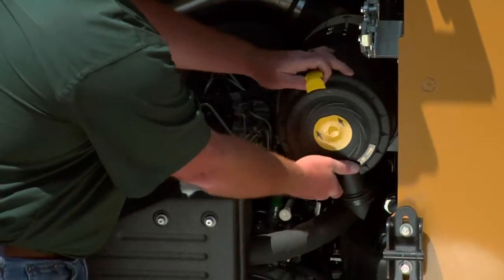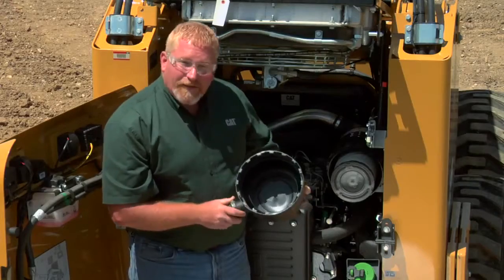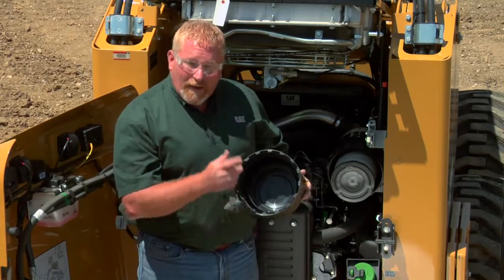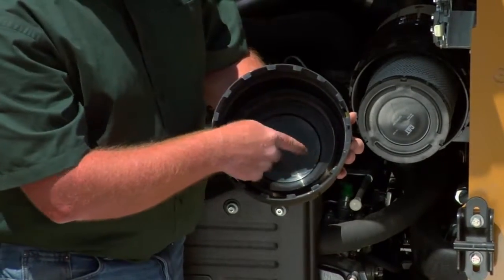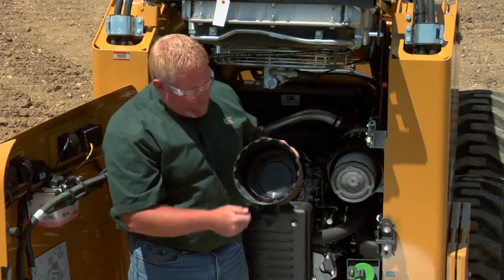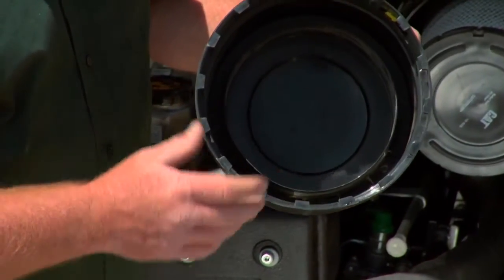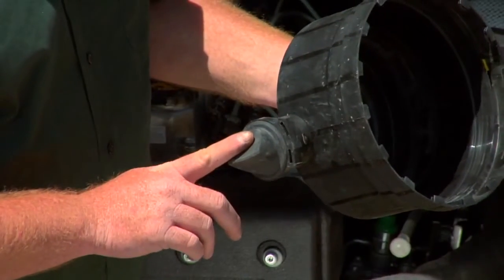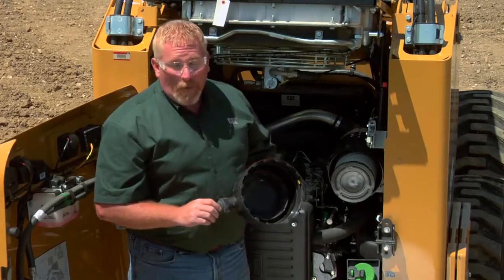I'm gonna go ahead and pop it open. Most people just think this is just the lid — well it is the lid, but it's also the dust ejector. What the dust ejector does is as the air comes into the air filter, it's swirling around the outside of the air filter and gets deposited all the way back here behind this ring. Now as long as the dust is loose, it comes down, falls through a hole in the bottom, and out the bottom of the dust ejector. What can happen, especially if you work in rain or wet conditions, is that dust turns into mud and can actually plug the bottom of this dust ejector, which can pack our air filter more and more full of dirt.